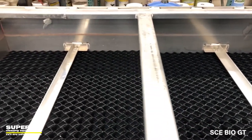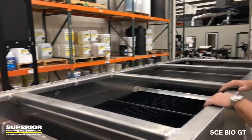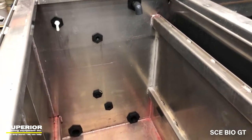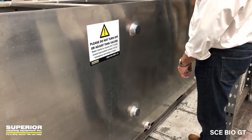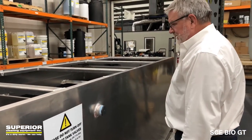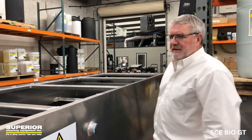Coming down until you get into the final finished water tank in the back, where your water is ozonated. On the final side, it gets pumped back to the pressure washer control panel. We're always running the water — we're going to put a ball valve on here and run this 24/7. We'll have ball valves below for draining and cleaning of the tank and the grids. An option is to put an automatic purge valve on the last one, so you leave these cracked open and every night, on a timer system, have that valve open to remove any solids that have gathered in the bottom of the tank and run them back to the pit.